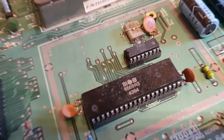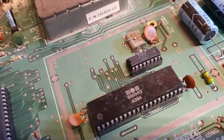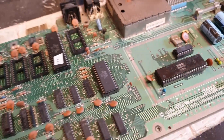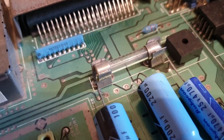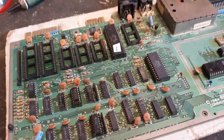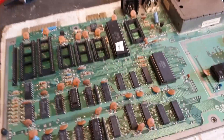I've seen complete black machines where the 8701 there is dead. Normally when that dies, you get no clock out of it whatsoever, and then you get nothing on the screen at all. You turn it on and it looks like it's got a blown fuse, because there's no power going to the VIC. But you can test that by having a look at the board itself, and you'll see there's no activity, no data, nothing at all, because there's no clock going to the CPU.